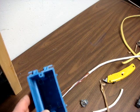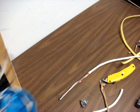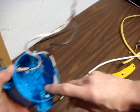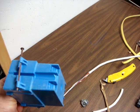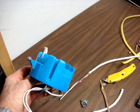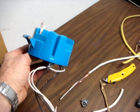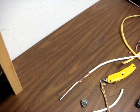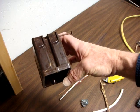There is one exception: plastic boxes all have integral cable clamps that hold the cable in place, with the exception of single-gang boxes — these just have pry-outs. If you use boxes with integral cable clamps, the Romex must be stapled or secured within 12 inches of the box. If you use a box with the pry-outs, it must be stapled within 8 inches.